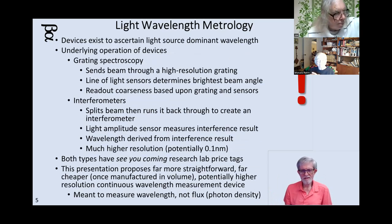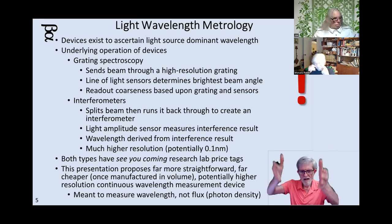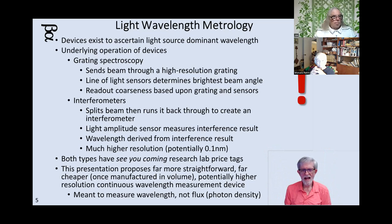I've often mentioned the concept of metrology — it just means you have some way of digitally measuring something, quantifying it. We have the ability to do spectroscopy, where we can take a broad spectrum of light in, and we can pick out the rainbow using grating or prisms to bend the light so we can break it into its component colors. Then we put sensors at the back end of the grating or prism to capture the brightness on different color bands.